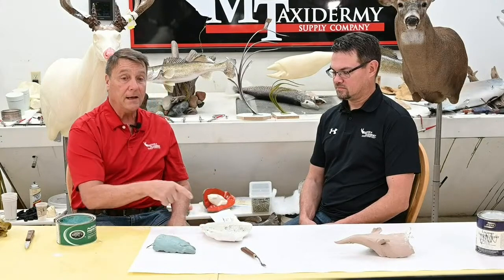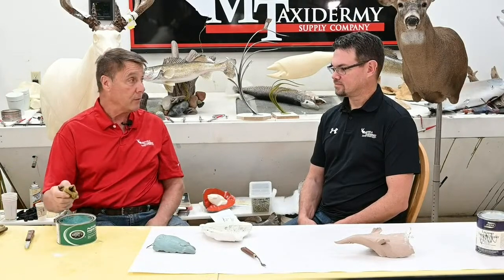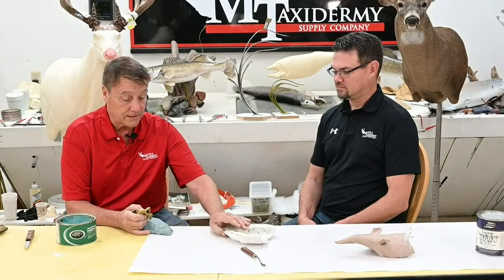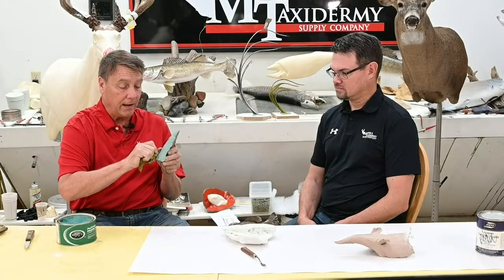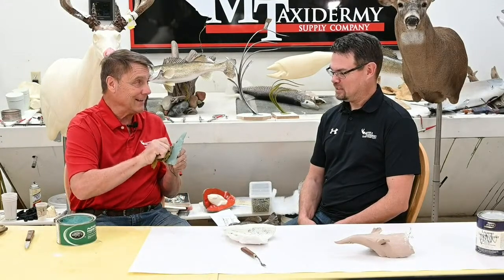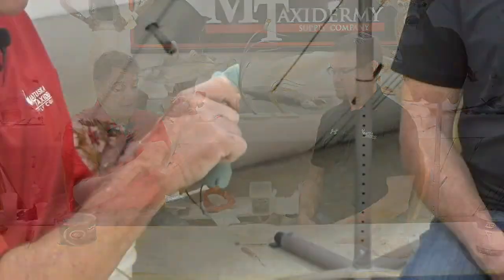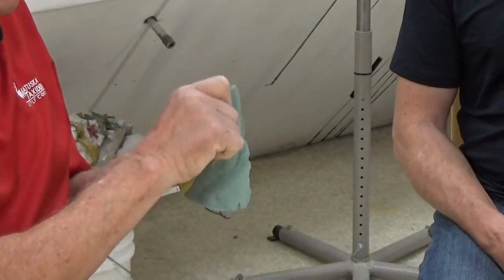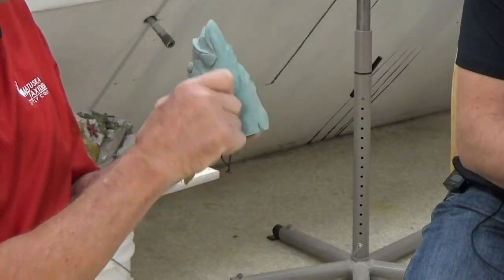Now, once he put the sealer on there, the sanding sealer, we take a little rag, any kind of rag, dip it in your paste wax, and you're going to work it into every little crook and cranny. I don't want to ruin this one because it's ready to pour, but you're going to just kind of massage it in there. Work it under every little crack. If there's places you can't get, take a little brush and work it in there. Little circular motions work exceptional.